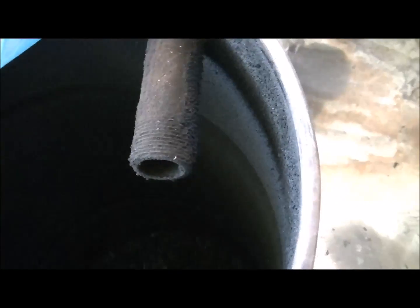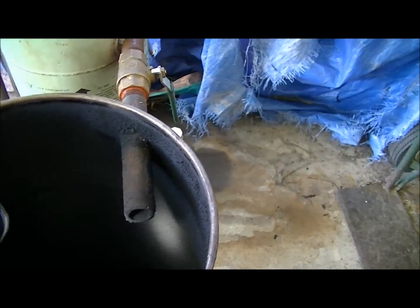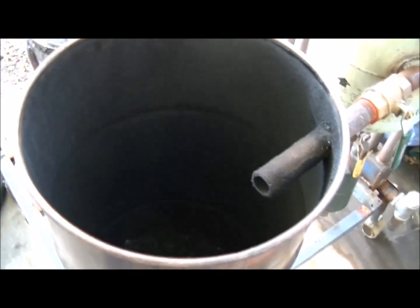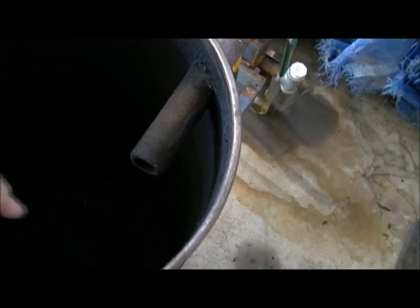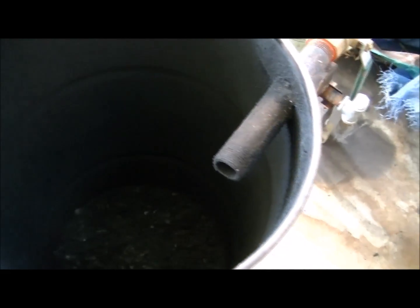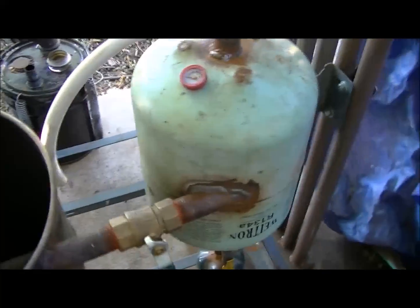While I'm looking here, I've got kind of a cyclone type idea that I put in. This is where the gas goes out and then into my other cyclone. When I put the reactor down in there, this tube fits the inside circle of that. My idea was to draw from the inside of that to get a swirl on the gas to hopefully drop the ash out a little bit more before it gets sucked into this second one.